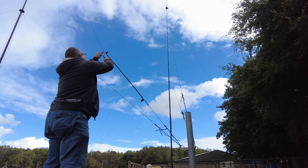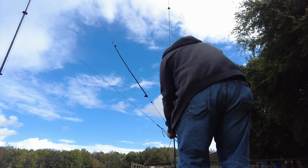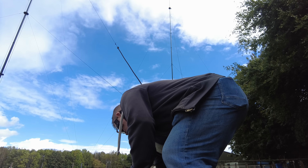I'll just cut the extra length there. We'll come back and sort it out in a minute. I'll just do number three and then I'm going to give you a tour of the antenna field and tell you what I'm going to change. Apart from that, we've got a 160 metre dipole to put up — well, I'm going to make it a fan dipole: 80, 160.